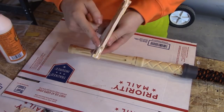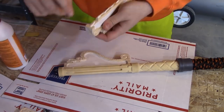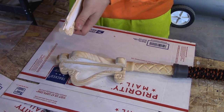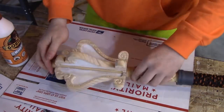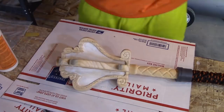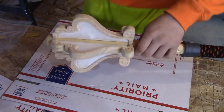Now it was time to attach the flanges to the shaft. This was just done with some wood glue on the mortises and tenons. I labeled them prior to this so I knew the order they went in because I had to do a little bit of hand carving on some of the mortises and tenons to get them to fit together nicely. Unfortunately, I forgot to put on the one PVC fitting that goes directly below the flanges before I glued the flanges on, so I ended up having to saw it in half and glue the halves around the shaft later on. It just left some little gaps that actually gave a more forged look to the whole piece, so I wasn't too upset about that.